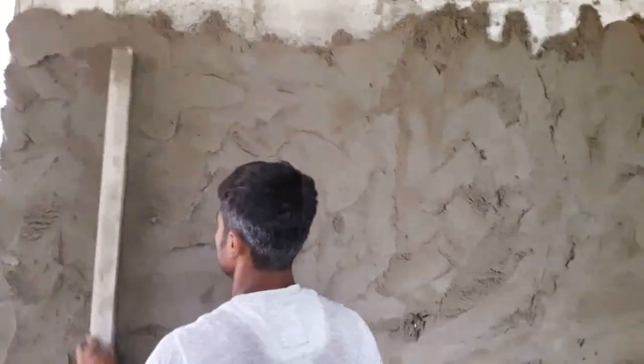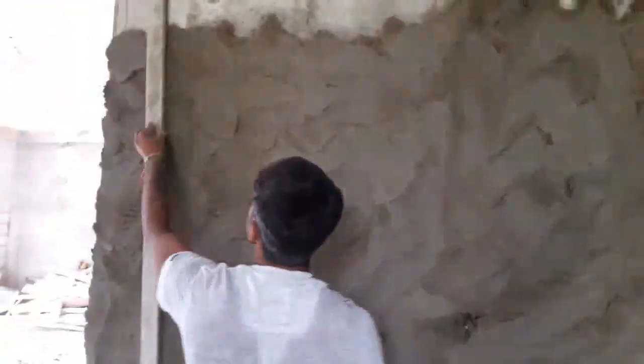This is the wall after applying the first coat. After applying the first coat, when the plaster is tough enough, you can screed the wall by dragging the straight edge along the wall. This screeding takes any excess plaster off the wall to achieve a nice flat finish. Start at one side of the wall and work your way across keeping the straight edge level, then work your way back across the wall.